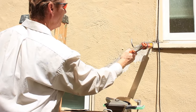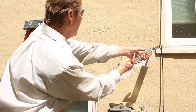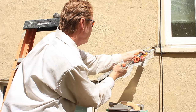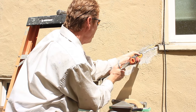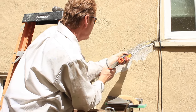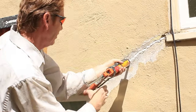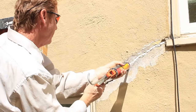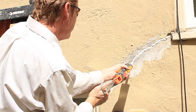Here's another tip, guys. This has been left in the sun, so now it's workable. I took a fat screwdriver and just opened it up. Sometimes when you have these polyurethane caulkings, you leave them in the cold truck and you don't open the tip full blast. I took a screwdriver and just jabbed it a whole bunch of times. I want this stuff to go in here and fill out.